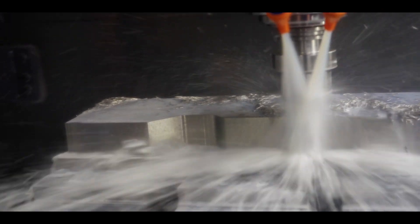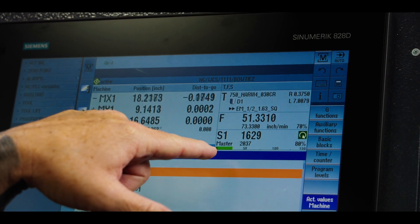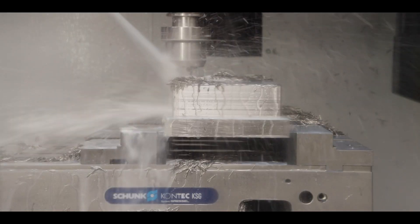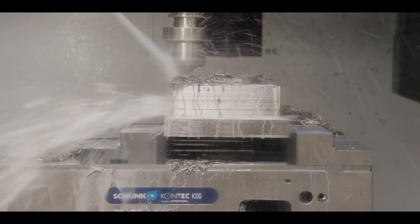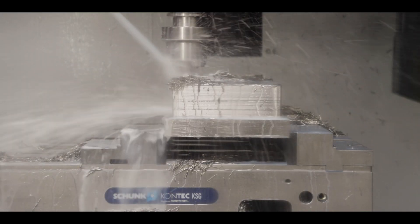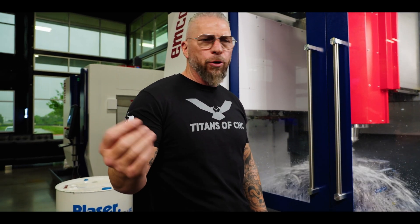The texture is really good. See this groove over here — I'm just in that groove, just getting that material out. Look at the load — it's barely over 25 percent. It sounds a little loud because you've got the holder hanging out and the long tool hanging out. We have a smaller radial cut, so the surface footage is at 400, a little bit higher RPMs, and the feed rate is at about 0.004 per tooth.